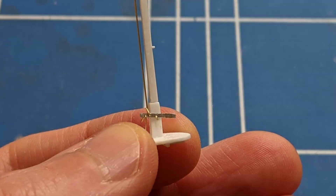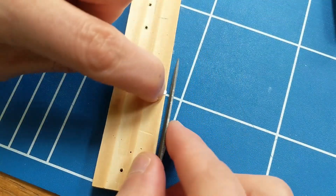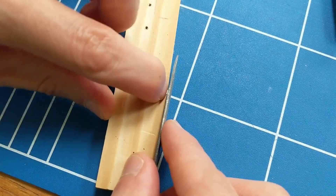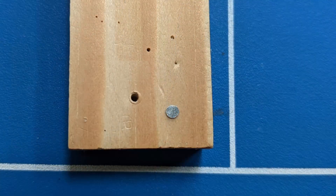So I made another straight one, this time with lots of space for a balance weight. Making a balance weight also proved difficult. I couldn't find anything that seemed to be the right size already. Track pin heads were the closest but were too small, so I filed a square piece of aluminium. That took a long time, and I didn't quite get it circular, but some more time and patience should get it there.